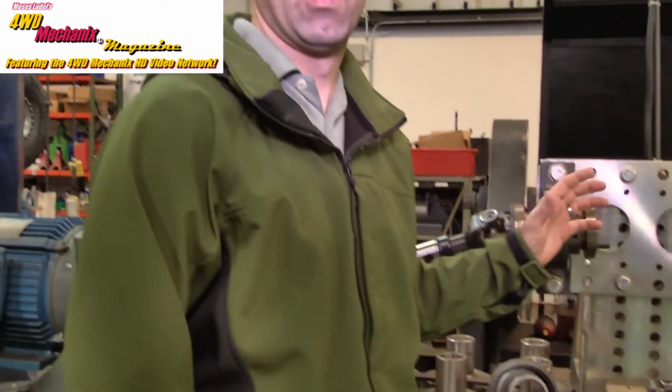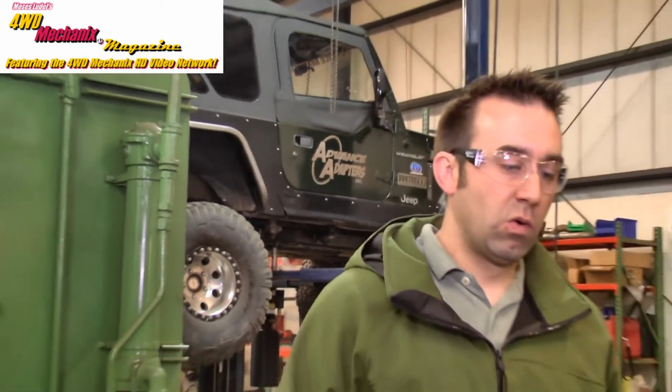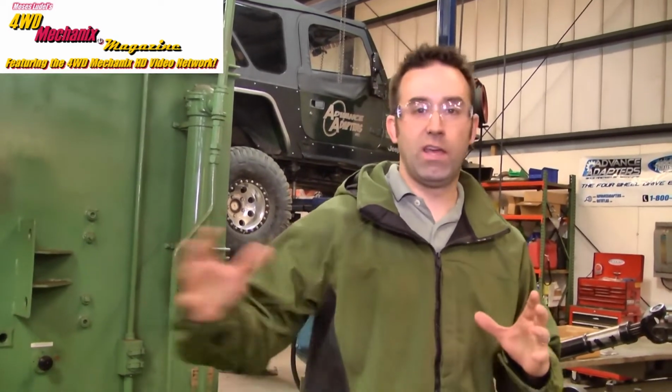The only power required to drive that system is the frictional losses in the gears and seals and bearings. So we can induce a high amount of horsepower with a small power motor. Using this machine, we can run approximately 300 horsepower in a loop for many hours during the day without putting the transfer cases in a vehicle and taking them out in the field.